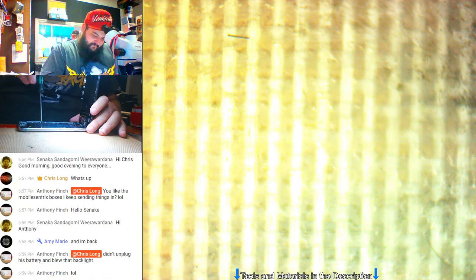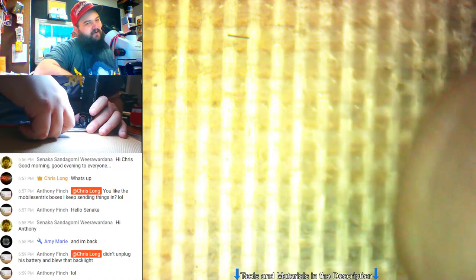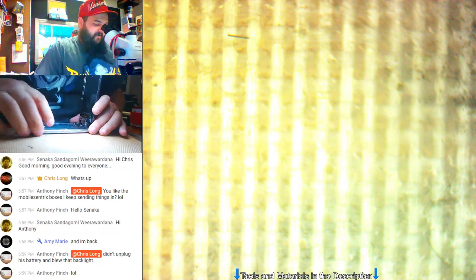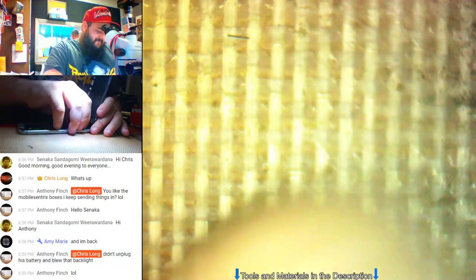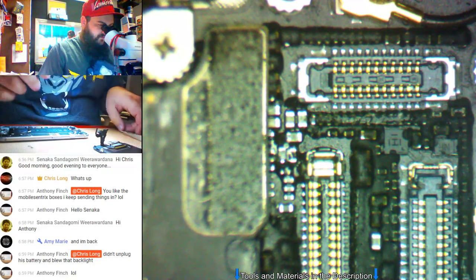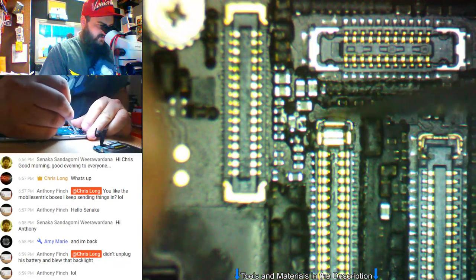More than likely, if we can get it fixed, we can take the memory out of that and put it on another one that's working, which is what I'll have to do, because I've got some very important financial information. When the screen went out, it had a passcode on it, so I couldn't back it up. And I've had to reset the computer since the last time, because I forgot the password. Unfortunately, to swap the memory, you have to swap the CPU, baseband, and EEPROM chip, which is extremely difficult. Is it? Yeah. So let's try to get the backlight working. That's 100 times easier. Yeah. They've been in here messing with it. That's for sure.